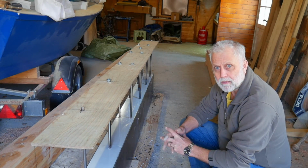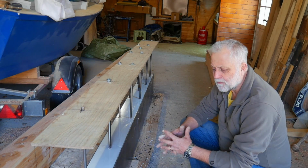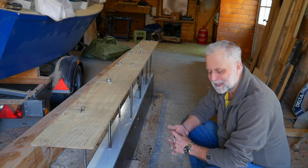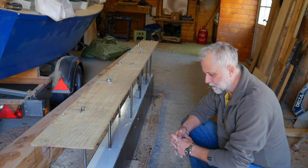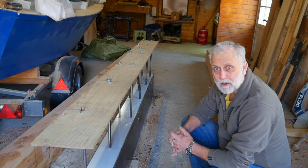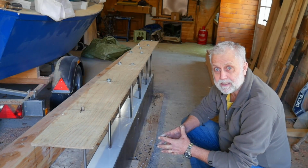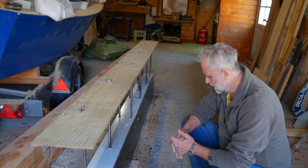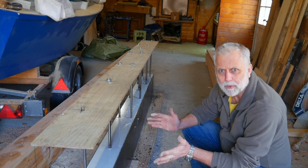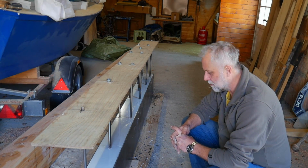So I melted 1250 kilograms of lead, and I've measured my average lead pour quantity to be 5.5 litres. So I'm doing 5.5 litres per pour. Lead's 11.34 kilograms a litre. So do the maths, you'll work out that it's 110 litres in total of lead. 5.5 litres a pour, 20 pours, and I reckon that's about right. I didn't count, but I think that's about right, 20 pours. And I say, come out very well.